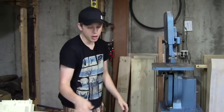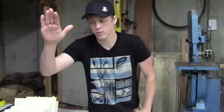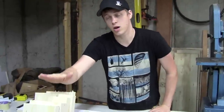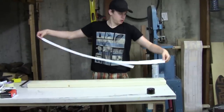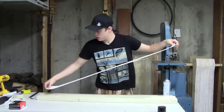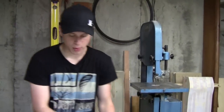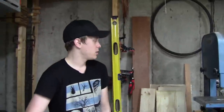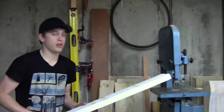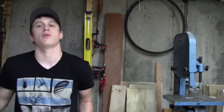What we are going to do is glue this down onto this board with some adhesive spray, cut it through the saw, cut down on our lines, and then sand it out to the right shape. Then we are going to use these two boards to actually lay out the rest of the shapes on these boards. Now that we have our shape on the 2x6s, I am going to cut it up on our saw, get this one cut up, sand it down, and then show you how to use this piece to actually lay out the rest so you can get that concave in the board.